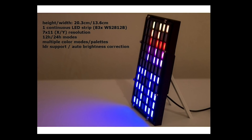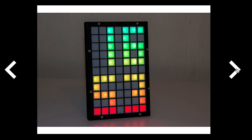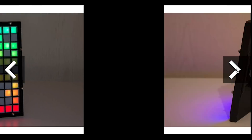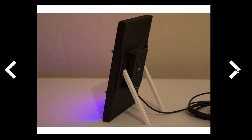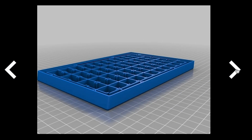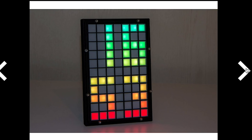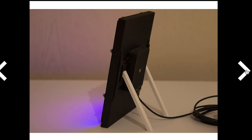On Thingiverse, Daniel Sikic has a guide up on making this color LED pixel clock with a 3D-printed structure. The framework is designed for you to neatly sneak NeoPixel strip around the inside, but also blocks out light bleeding over from each pixel. There are 83 LEDs in total, all linked up to an Arduino Pro Mini and a real-time clock module to keep precise track of time. It's a good-looking payoff and there's even a little enclosure for the Arduino on the back to keep things tidy.